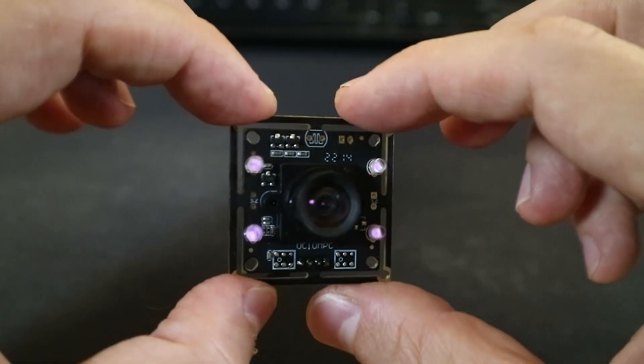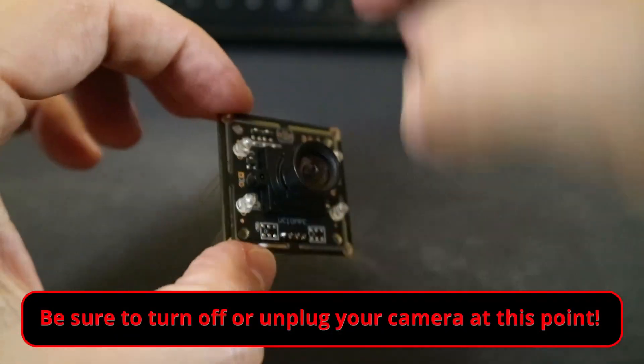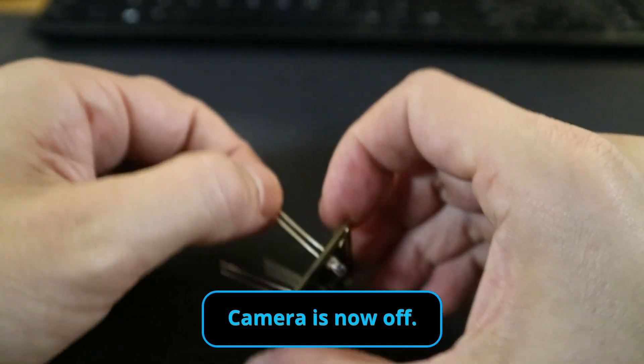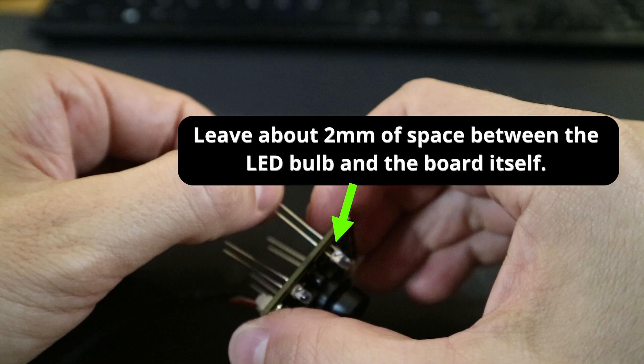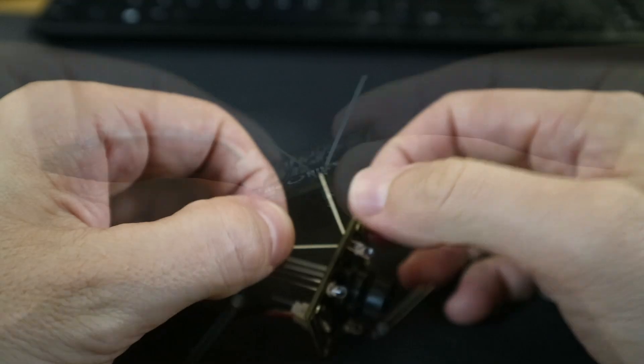Here is what all four should look like. Note that this is not visible to the human eye. Before we start soldering, be sure to turn off or unplug your camera at this point. I'm also going to slightly bend the leads to hold them in place, but when you do this, be sure to leave roughly 2mm of space between the LED plastic and the board itself. You'll see why this is important later.